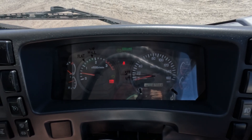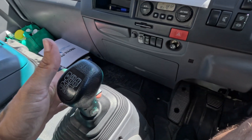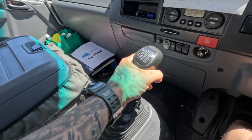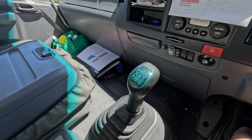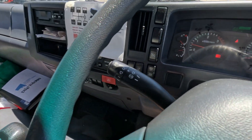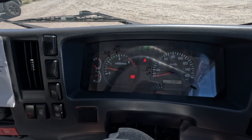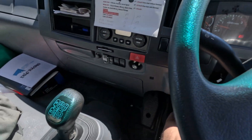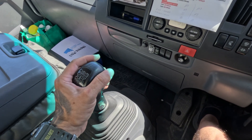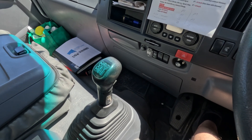What that means now is, if we're at sixty kilometres per hour, our gear lever — the range selector is going to be up — and we're going to be in seventh gear. Say we want fifth. Remember, we're doing sixty kilometres per hour. We're going to brake all the way down to twenty-five, and then once we get to twenty-five, we're going to go neutral, across, up to fifth, bring your clutch out slowly, and then turn the corner.